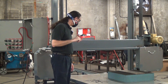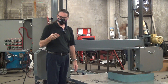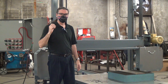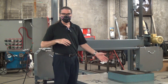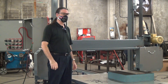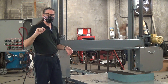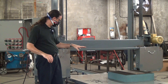We are using instead what we call a honeycomb style blade — a one inch wide, four tooth per inch honeycomb style blade. It cuts with a hybrid slicing knife type action, but it also removes a channel of material. It produces a kerf so the blade can travel through stiff materials very easily. In general terms, soft squishy materials like seat cushion foam can be cut well using a scallop edge blade. Rigid materials — wood, hard foams — usually require a hook tooth style blade that creates a kerf. This honeycomb blade is a hybrid and it's given us a very good result.